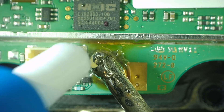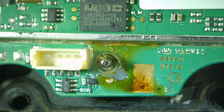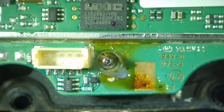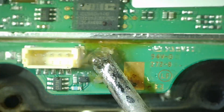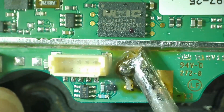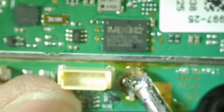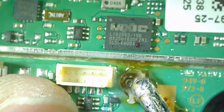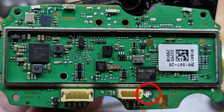I pretty much got it all on top, but you can see some silicone left over here that oozed out from the bottom — that's one thing we're battling. I'm going to heat it back up. This low melt solder will stay liquid for a while, and as I pull up and break the silicone there's no possibility of damaging the solder pad because it's still liquefied. And there we go — removed just like that.